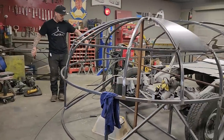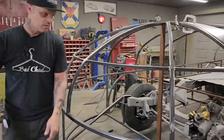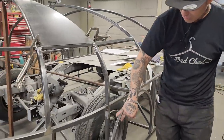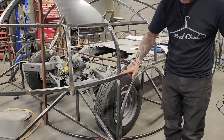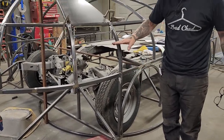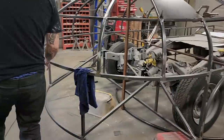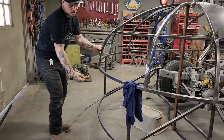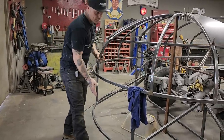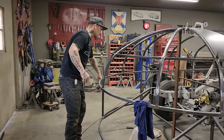Also, the front, once I get that sheet on halfway, I'll come back over this side. Once I get that sheet running down there, get that sheet running over there, then I just gotta run a sheet here on its straight edge, on the bottom, probably I'd run it on the top, and the reason being is I can cut it off at the bottom. If I run it up over, then I gotta come up here by the window and start cutting. So we run it up here, we'd run that sheet all the way around, we'd run a square stock down here, we get it cut in the middle, then we cut the bottom off, and then we've got that sheathed in there. With that metal wrapped around there like that, held in nice and tight, there's pressure against that metal. We're making memory for it. We'll do the exact same thing there.